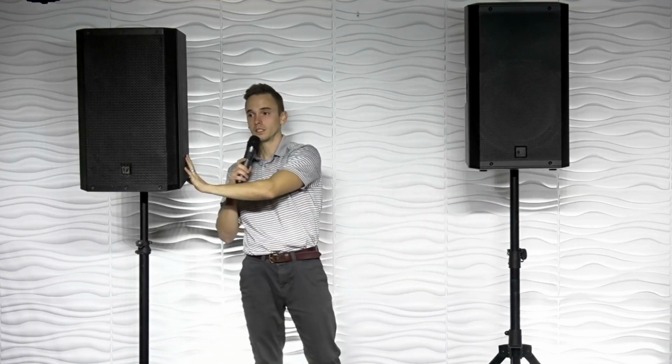If you're mainly doing a lot of vocals, if you're not really needing a whole lot of music, so if you're doing an outdoor event, something like that, and you're mainly just having a lot of mics and stuff, you got a lot of speakers, or maybe even a corporate event that doesn't have any dancing, like they're doing a seminar or something like that, linear mode is what this is for. And speech is on this one. The boost mode on this one is like the club mode on this one. Club mode just provides more low-end punch. Boost mode provides more low-end punch as well.